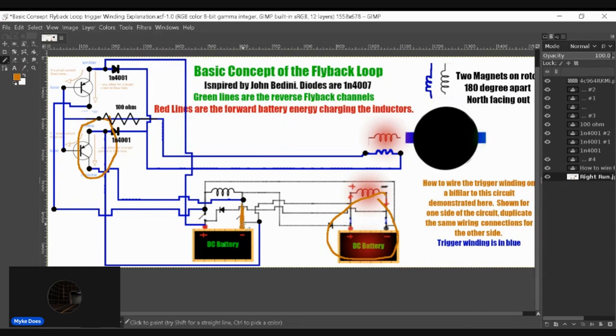It will cause the negative channel to close again, because the positive flyback goes through here, through here, through the diode, hits the base, and the negative flyback goes through here and hits the emitter, causing this to close. I don't see that as a problem, because to get this side of the battery to charge this inductor, you need both channels to close, not one. Okay? So having a trigger winding will possibly cause one leg, the negative leg,